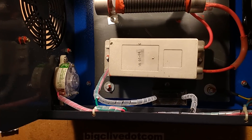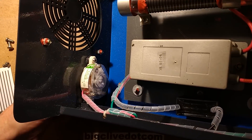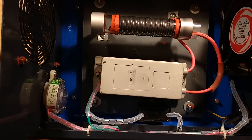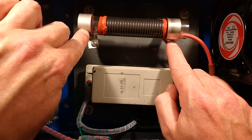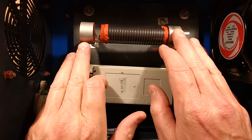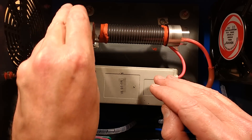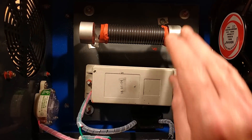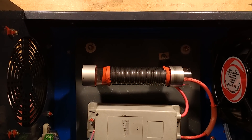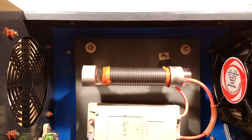At this end of the unit is a little timer — a time switch that lets you either turn it on manually, with a little cam operating the switch, or use the time mechanism. There's an insulating layer at the bottom, mainly because the metalwork here actually becomes live — it's one of the connections. It's quite flimsy but I think it's stainless steel, just a metal strip with a rubber washer to grip the tube without squeezing it tightly enough to break it. So I'm going to turn this on now, move it back into the picture, take the exposure off, power it up, and we're going to see if we can see the corona discharge.